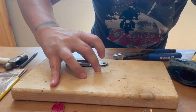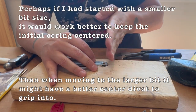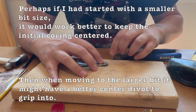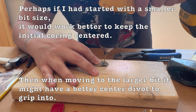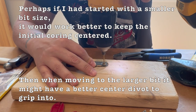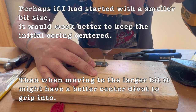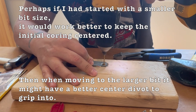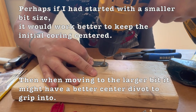Man, it's so easy. I wasn't taking my own advice to take my time there. So easy for the drill to speed along off course and start to bum up the rivet. Like I said, this is the part where you're supposed to take your time and I get impatient, hence having bought the backup rivets. I think if my center punch had gone a bit deeper, I might have had better luck as well. Yeah, now it just wants to slide out of place.